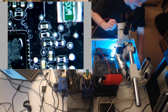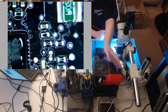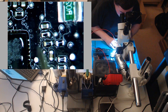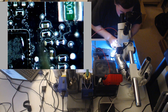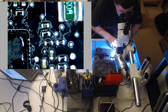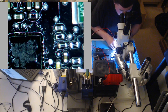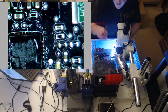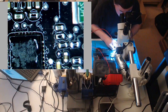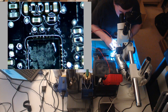My guess is we got a dead ISL right after I said that I don't have problems with Lewis's chips. So it wouldn't surprise me, that does happen from time to time, and given its voltage, it's a possibility, but let's check right here. Current sense looks good. Let's see. Alright, my guess is we just got a dead ISL. This happens from time to time.